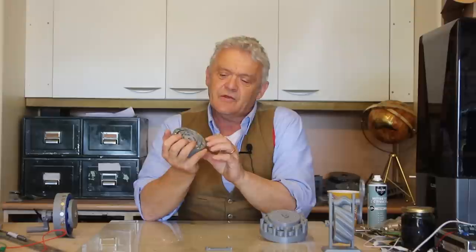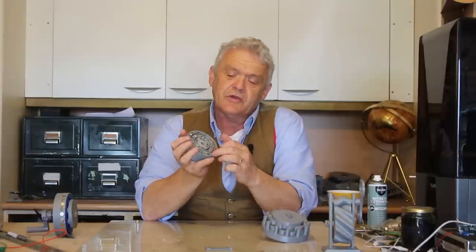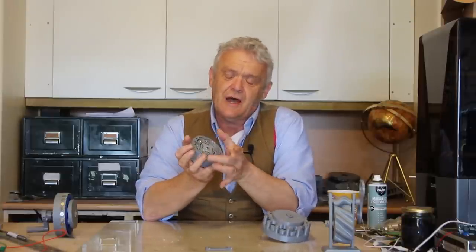But if you remember, we also made this — a magnetic gear set. The gear ratio on this is 3 to 1 because we've got two pole pairs at the center and six pole pairs on the outside.